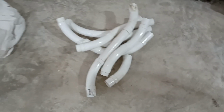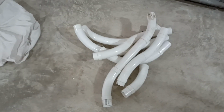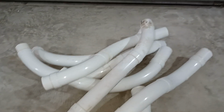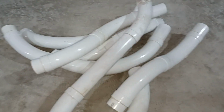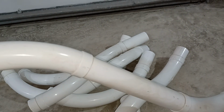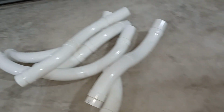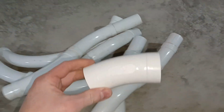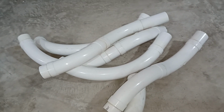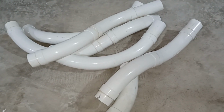So this had twice the amount of resistance through the piping that is really prescribed. And it wasn't necessary. In the space allotted for this piping run, in this basement ceiling, we were able to eliminate a couple of these 45 transitions entirely, and a couple of them we replaced with 22-degree offsets. Testing out that system again, it's a night and day difference. It works much better.